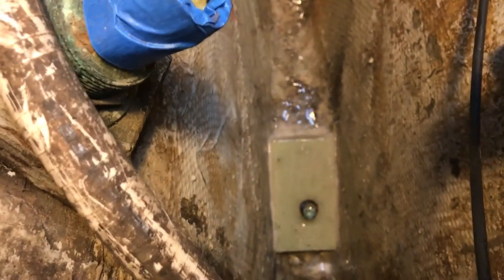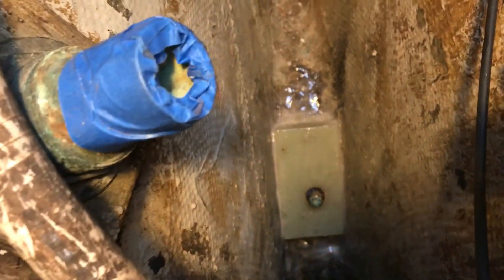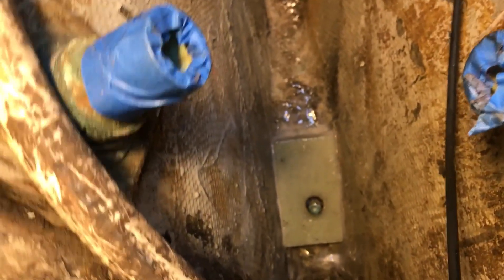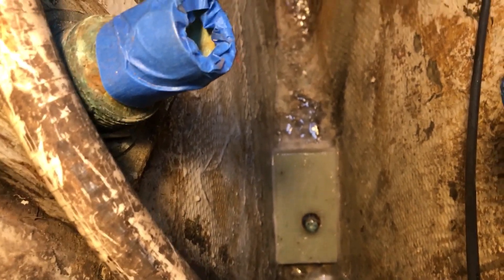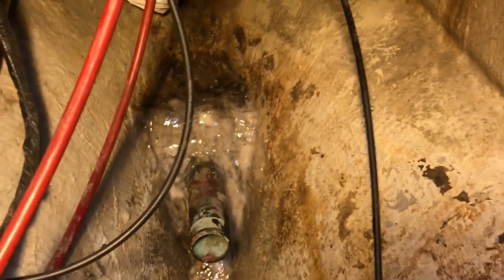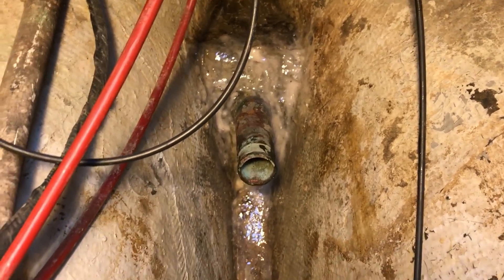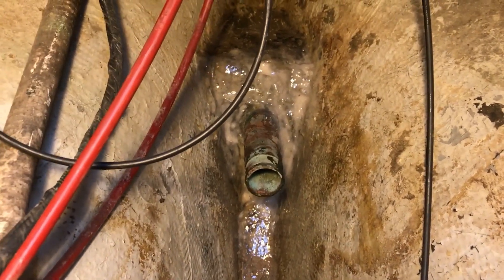I have epoxied in a piece of G10 board — G10 fiberglass board, extremely hard. It took me a long time to drill that piece; it's like drilling stainless steel almost. I also worked on that area around the stern tube that had the shoddy glasswork — chipped off what I could, laid down some epoxy, then some more glass, and then more epoxy on top of that.